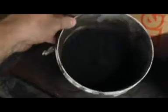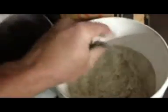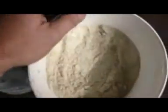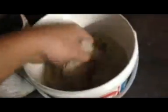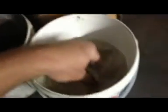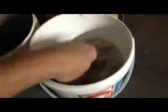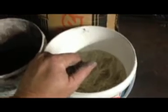The other component that I use is that one there, which is basically coal dust, which helps get the finer detail in the actual component. The binding agent that I use is the clay powder, you can see there, which is a bentonite clay powder. You can buy it commercially. I'm lucky enough that I have a founder not too far away who sells me this stuff, but you can make it yourself, I believe, out of the clay clumping kitty litter, which is also made from the same sort of material. You'd have to crush it up into a powder for it to be able to be mixed, but that's essentially what it is.